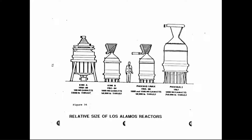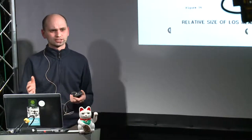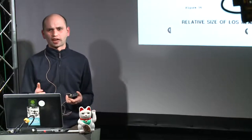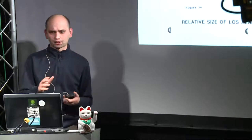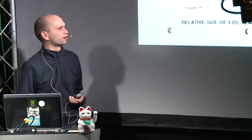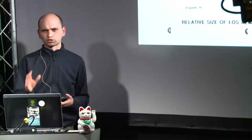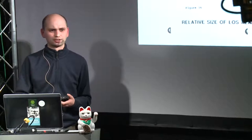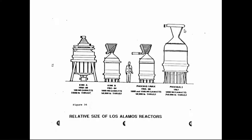broke up during operation. Actually, at the kind of temperatures you want to have here, above 2,000 degrees, there's essentially no material that will withstand this for any kind of time, and it will slowly erode. They've gotten better with time. At first, they broke up quite readily. Later, they had better materials, and the erosion rates came down, and a lot less radioactive material was released. But yeah, whatever was released came out of here and was released straight into the environment.